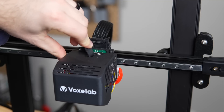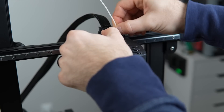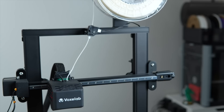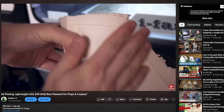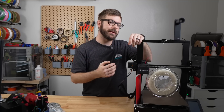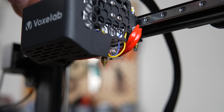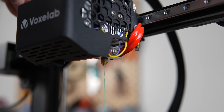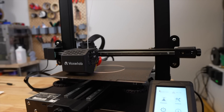For the extruder, there are no specific requirements, but as always having a higher quality extruder is going to help make sure you get more consistent results. Bowden or direct drive is going to be fine, and based on my previous experience using foaming materials, any stringing or blobs are typically really easy to clean up after the fact. One unique aspect of this filament over a traditional PLA is that you will want an all-metal hotend if you're trying to take full advantage of that foaming property. Standard PLA is typically printed from around 200 up to maybe 220 Celsius, but to get the maximum foaming, the best temperature on this printer with this setup was 260 Celsius.